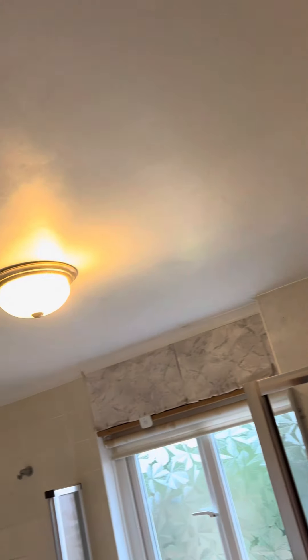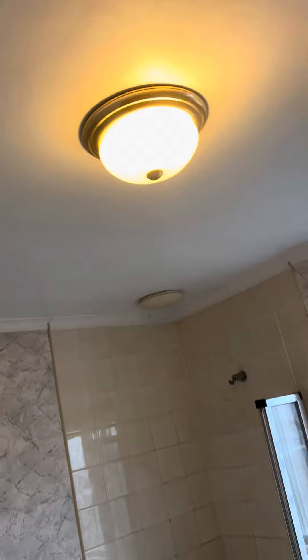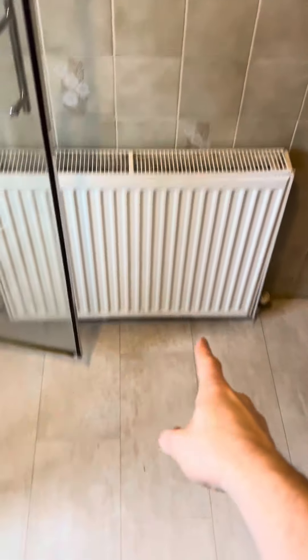Today, since I think I'm going to be getting up the carpet, we're going to do a chase for the light switch, fan isolator, chase into the loft, and then we'll have four JCC cans because the client wants Philips Hue lamps she can use via a sensor. There'll also be a new centrifugal fan in the loft and a shaver socket in the cupboard.